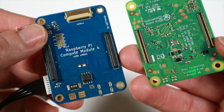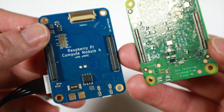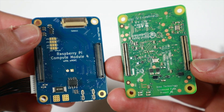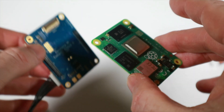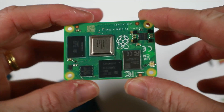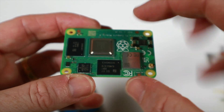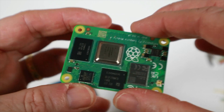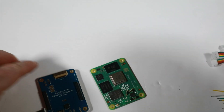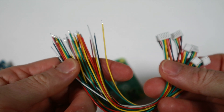The connectors are pretty delicate and it's very easy to break them if you take them apart wrong. There are actually some 3D printed tools for taking these apart that Flavio supplied me last time. I'm not going to put the CM4 on right now because I also need a heatsink — we have thermal paste that goes on a few of the chips, then we squash that down with a big heatsink to stop it overheating, because this will run quite hot.